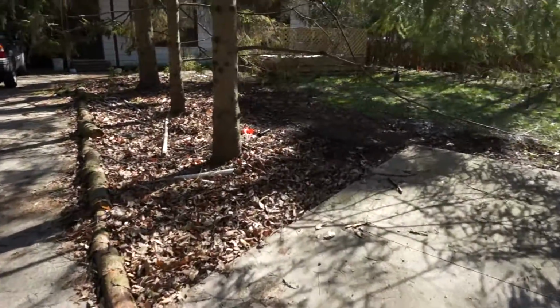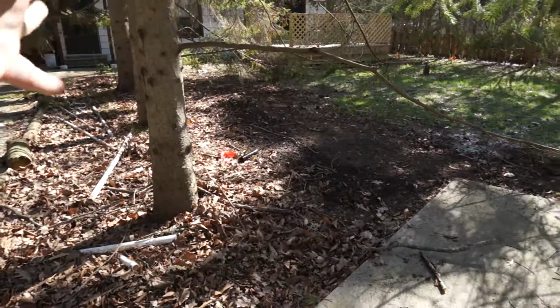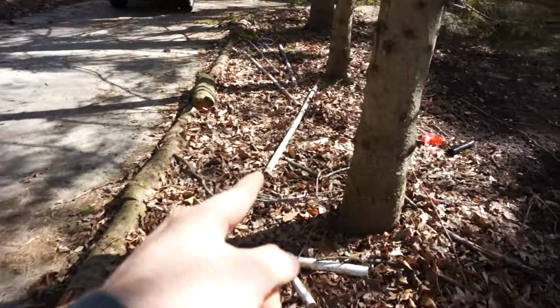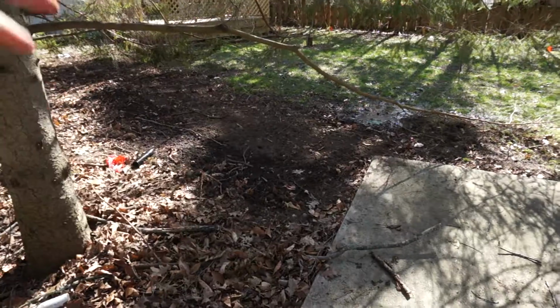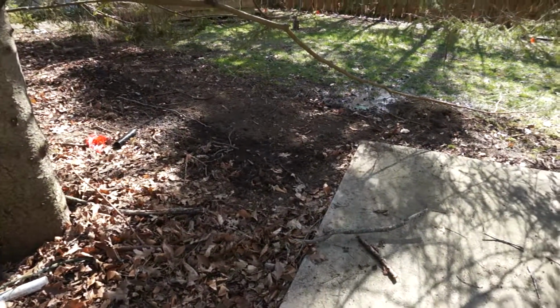Plan D was to dig up basically all of the pipe that led from the house out to the street and replace it with 4-inch perforated pipe. It originally had this 1 1/4 inch schedule 40 pipe. So this has all been replaced with perforated pipe that was backfilled with gravel, landscape fabric put on top of that, and then covered back up with dirt.